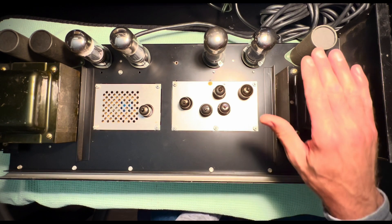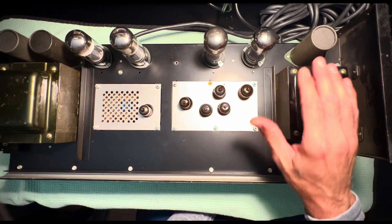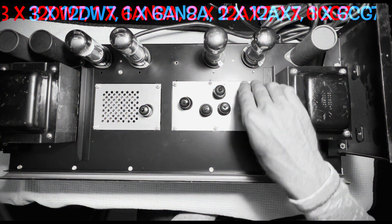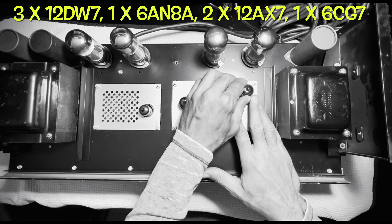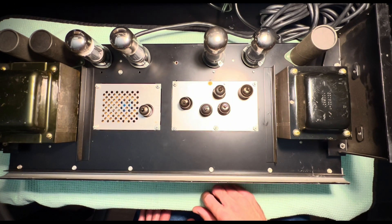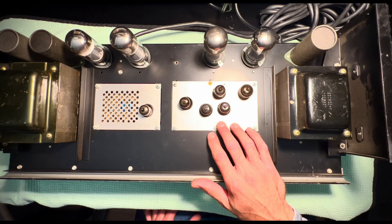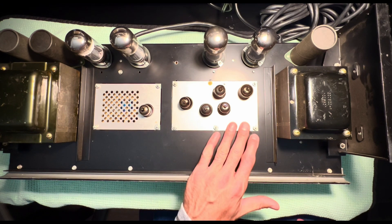These are the stock filter capacitors in their little cardboard shells. A stock complement of tubes with a cool little sliding or retractable tube shield that I think is just so cool. And they're missing from five of the remaining positions. These amps are pretty cool. If I remember correctly, it's been a bit since I worked on one of these. The annoying part is Ampeg's incessant use of the 12BH type tube, and it's only annoying because I don't usually stock those, though I should. But I do see these once in a blue moon.